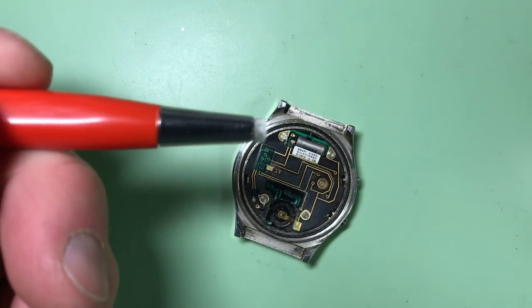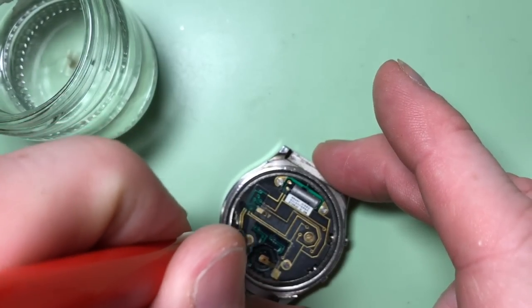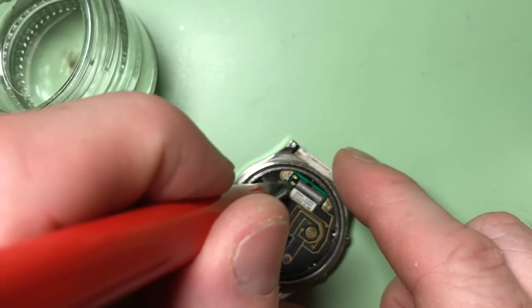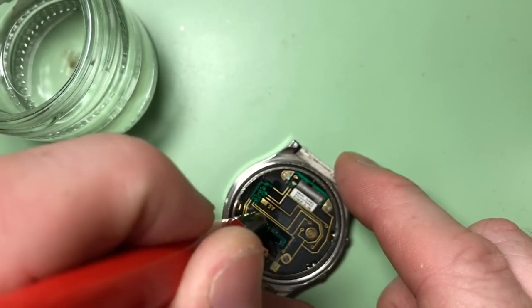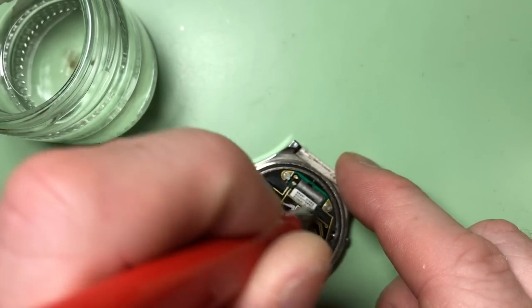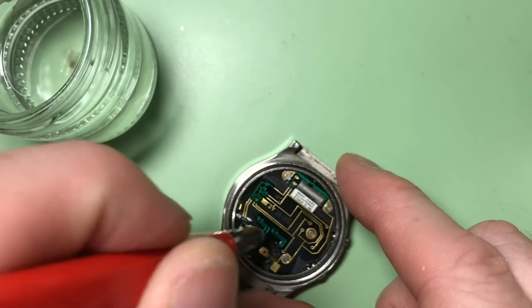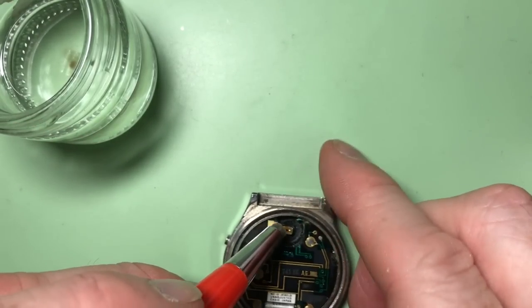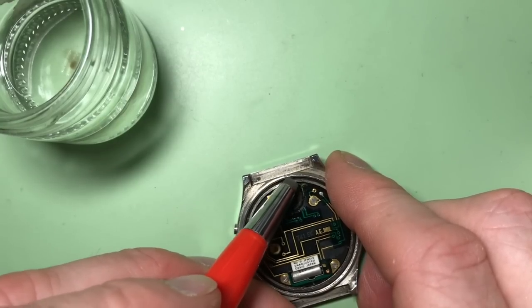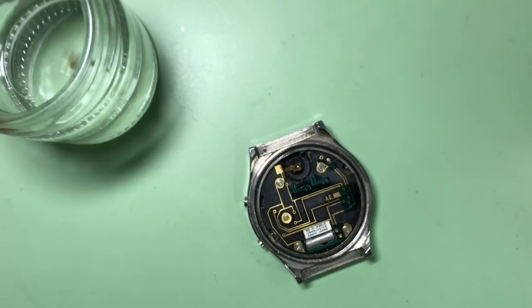So it is a simple case of getting your fibre pen, dipping it in the alcohol, which will quickly evaporate, and clean. Now, normally I'll be doing this under magnification again, so I can see what I'm doing clearly. So for the sake of the video, we'll just do this with my naked eye. Obviously the one particularly difficult thing was in here. Now what I also have is quite a useful tool. If I just find it,